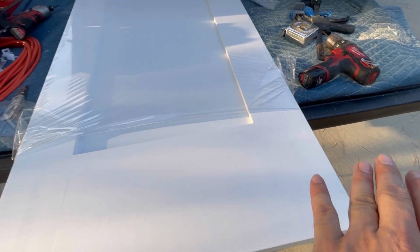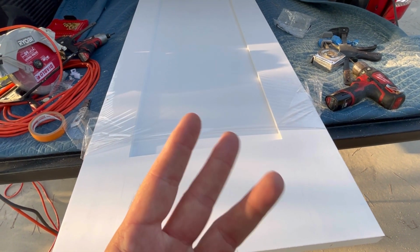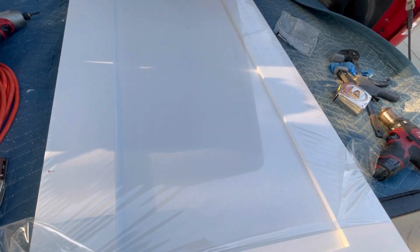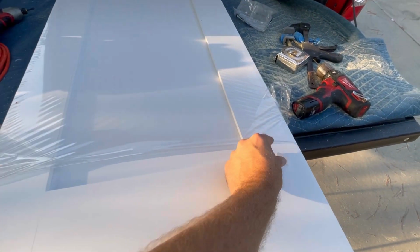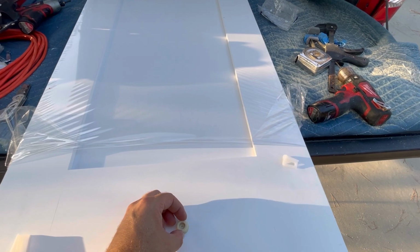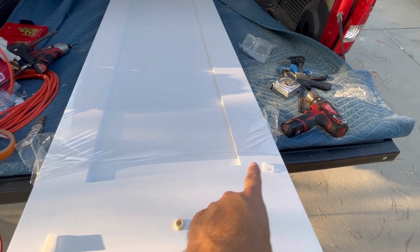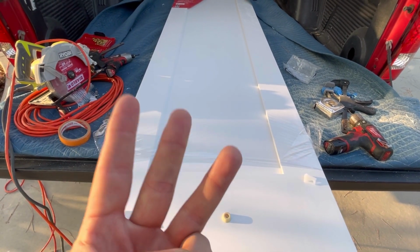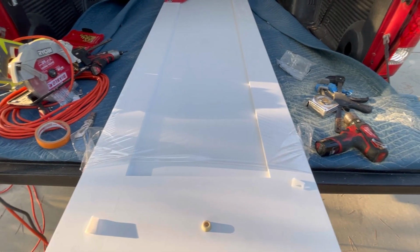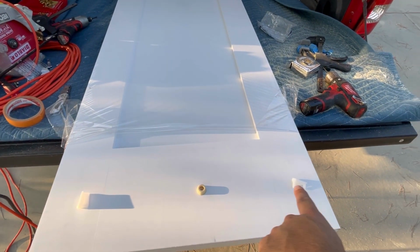When you are making a line, no matter how long it is, always give yourself 3 points. Why 3 points? Because if I only use 2 points, it can be crooked. But if I use 3 and you make a line through those 3, then you know if something's wrong. Always use 3 points of reference when you scribe a line across anything. And when you scribe the line, it needs to go through all 3 points. When we go like this, our line will go nice and straight through all 3.